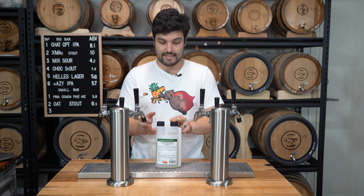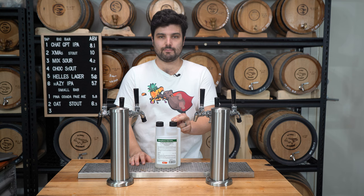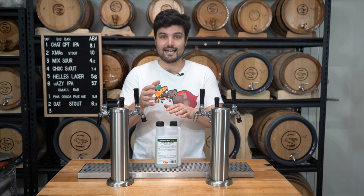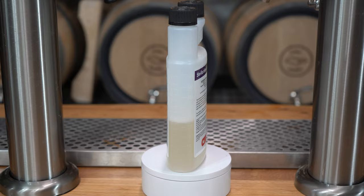Phosphoric acid is excellent at dissolving things — specifically great at destroying cell walls, which is why it kills off bacteria by literally making them explode. The one downside is that it doesn't foam up and doesn't have surfactants, so it can't cling to walls. That means if you don't have a way to coat everything or keep it in constant contact, it's not going to do a great job of sanitizing those surfaces. You'll need something like a spray ball to maintain that surface area contact.